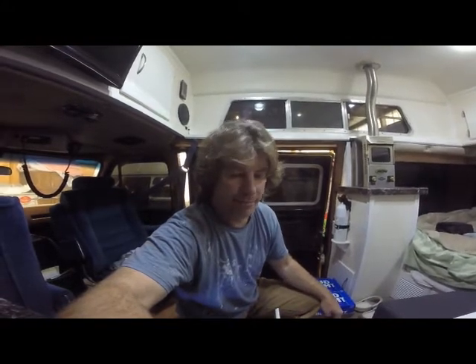With all that — 100 amp-hour battery, 230 watts of solar, and a good controller — this whole year I haven't had to use my generator at all. It's never come close to dying. Even on one day on my last trip that was cloudy and rainy for the overwhelming majority of the day, by the end of the day it had charged enough that I was fine through the whole night.